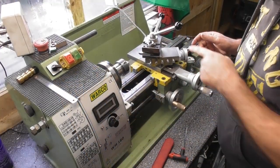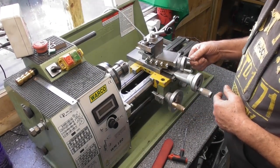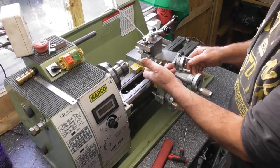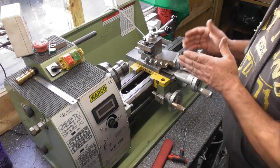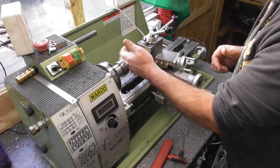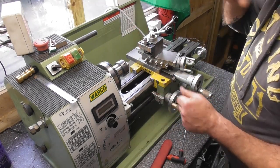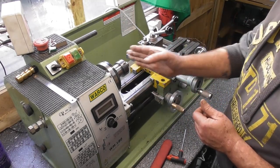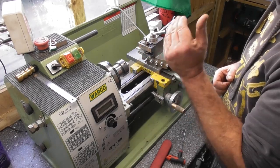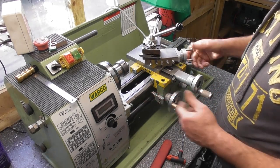I've just come across a small problem — I've come across it before but forgotten about it. My compound slide on this particular lathe won't go to 90 degrees. It's fouling on the handwheel to start with and I can only come to about 15 degrees, so my eight degrees is no good. I'm way too far forward, beyond the tool. I could rig a tool from the back or swivel around, but I can't get the angle I'm looking for, so I'm going to have to set the tool up at eight degrees and try to skim it in one hit.